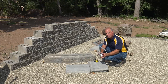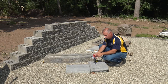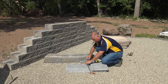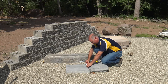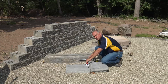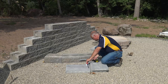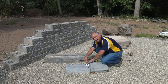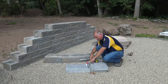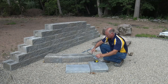I'm going to make my first measurement. I'll take my angle guide — the right side of it — and place it against my last laid paver, all the way to my right side. Holding the tool, I'm going to stretch this out. It's going to do one of two things: it's going to get my length but it's also going to get my angle. At that point I'm going to tighten this to lock it into place. This distance from here to there is the exact piece I'm going to need to fill this.